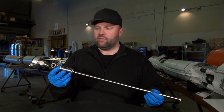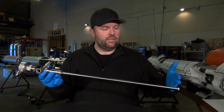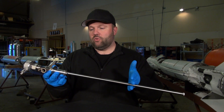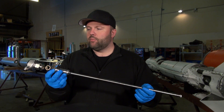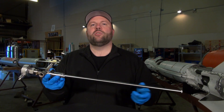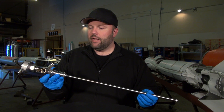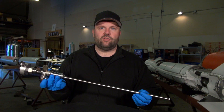What's going to happen is that when we fill up the oxygen tank, the liquid oxygen level will simply, just like any dipstick, slide up this sensor, and we will be able to electronically measure exactly what the level is. We just did the calibration with liquid oxygen yesterday and got confirmation that the data looks good, and we are ready to proceed with the installation.